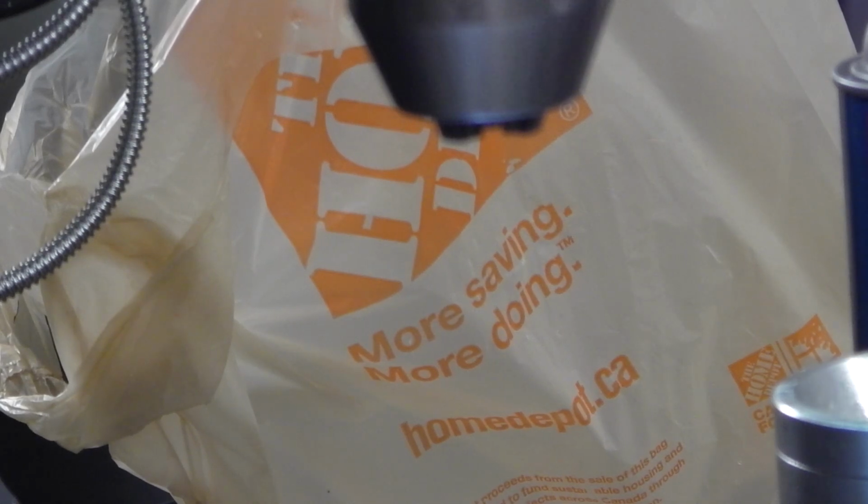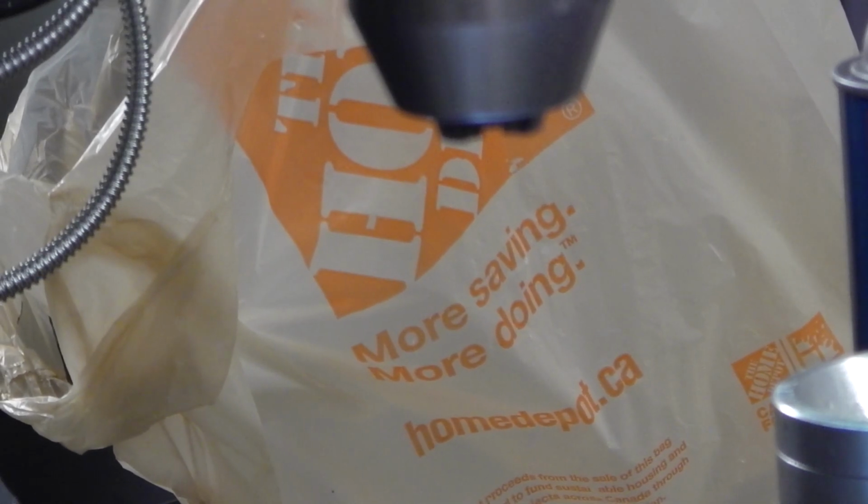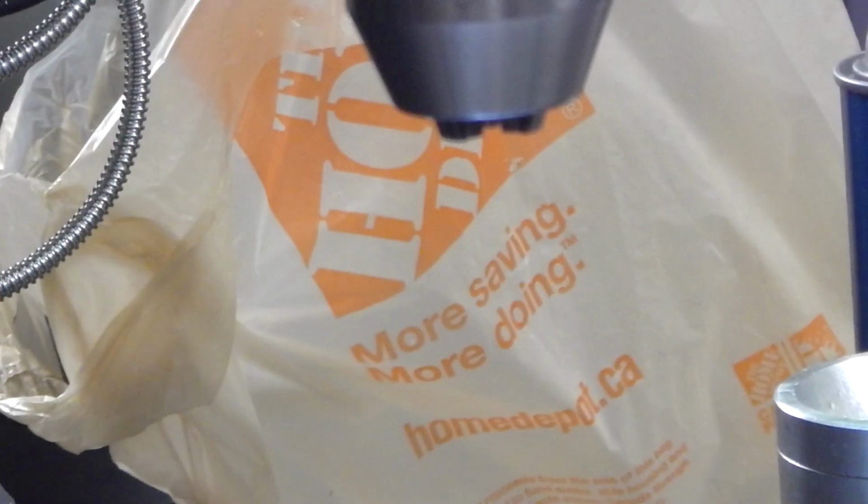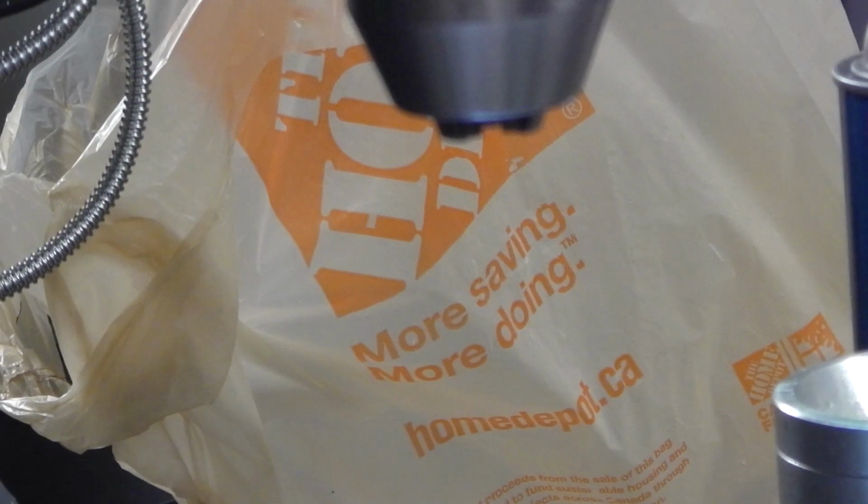And the next part is, I've got the small 1-inch timing gear here. Let me give you a close up. I've got to bore that to a 1/2 inch. That does not have a 1/2 inch, it's a 3/8 hole there. So we're gonna knock that one out to a 1/2 inch, put that on the lathe and cut her out. All right, hang in there, guys.